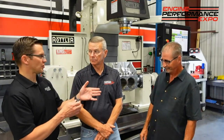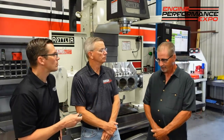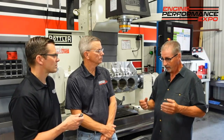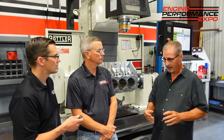Back to metallurgy — what would be some basic guidance for people cutting aluminum versus compacted graphite? You've got to use your manuals, your knowledge. The internet is very popular for that — do your homework. Go in and look at exactly what type of material you're using and what's recommended. The industry has been very aggressive on making different types to improve through metallurgy, but you need to know your commonalities, get that information, make sure you're buying the proper insert, the proper grade, the base grade, and the right coating to do your end job.